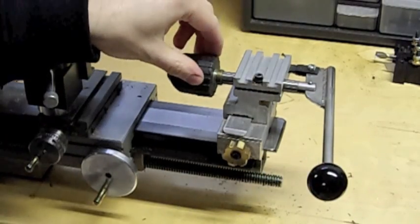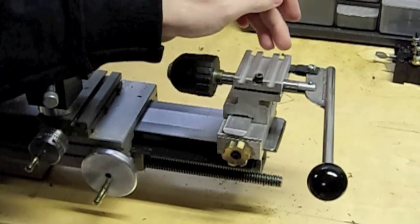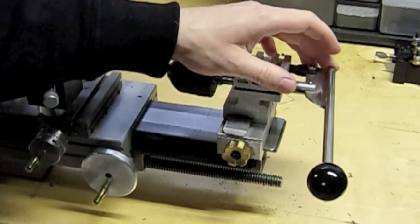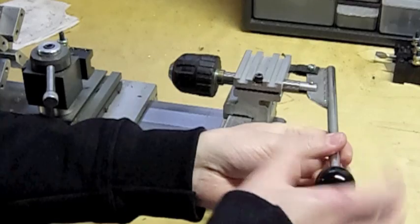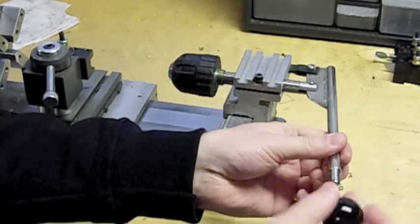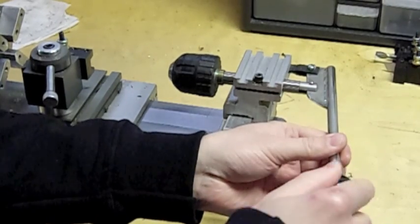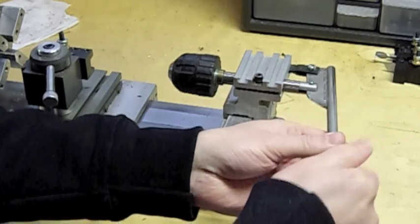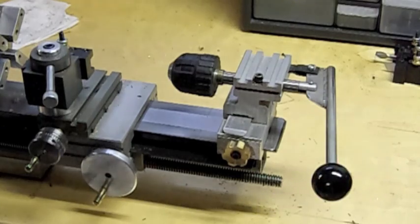This is all stainless steel. I've got a piece of flat stock here with the holes in it for the part that mounts to the tailstock. I welded on a piece of 3/8 inch thick solid stainless rod which is threaded at the end, for putting a nice 1¼ inch ball end on it for a much more comfortable grip. This lever here is about 7¼ inches long by comparison.